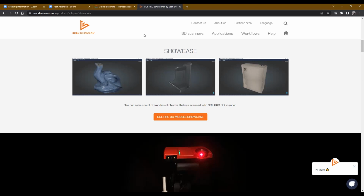Right. So often you think of using a 3D scanner and prototyping because you have an object and you want to scan it and be able to recreate it in some fashion. But often factories will use it to verify their molds, that they're getting the same measurements within spec that they expect to get over a long run of production. And very fast and with high accuracy. Whereas before, the engineers would be sitting there taking very detailed measurements. With this, a couple of passes and you can see exactly what you've got.